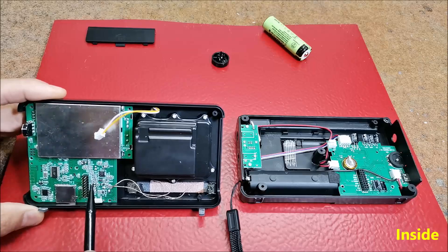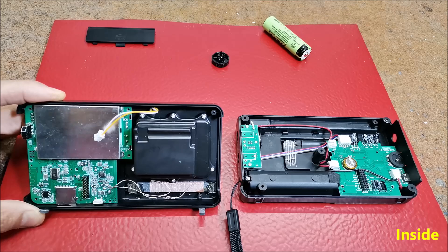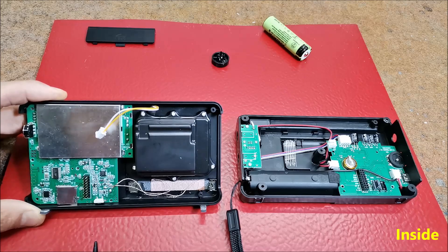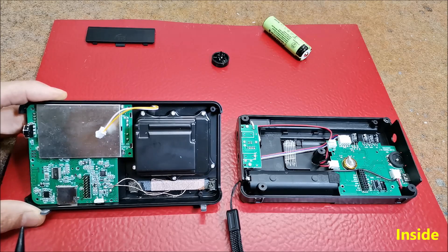I was very pleasantly surprised by the SI4734 radio chip used. So far I have built several radios with chips from this family, from the Skyworks brand, which is controlled by a microcontroller, and I can tell you that they have excellent characteristics. You can check out these DIY radios on my channel. The ferrite antenna is large enough for good reception in the medium-wave area. Behind this metal armor is the display together with the control electronics. The metal serves to block the digital noise generated by the display on the radio reception.